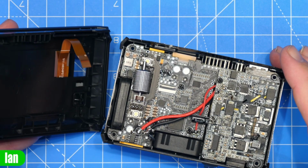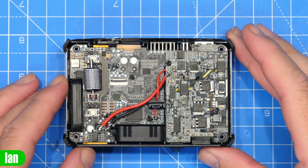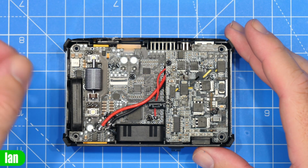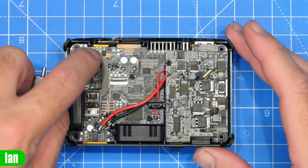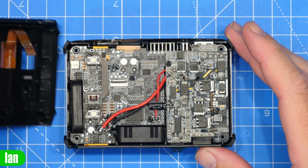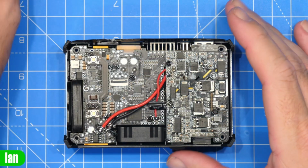Okay, I ended up using a little bit of heat on the sticker just to release the adhesive. So here you can now see the inside of the main top PCB. We have our little roller over here, and this is quite interesting. This actually just comes out. So it slots in to this little rotary encoder on this side here. And then there's the push button there that it presses on. And then in the lid, there's like a groove that holds it in place. And that is a fully machined metal wheel as well.